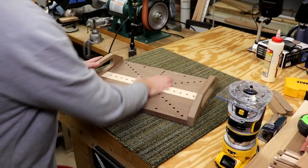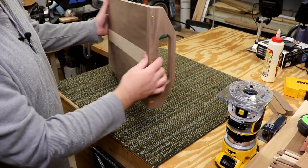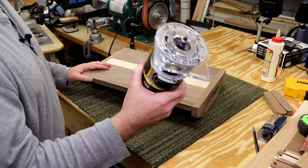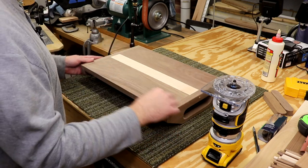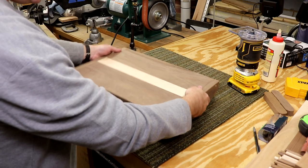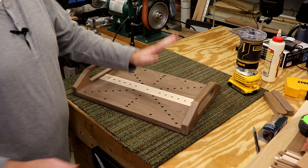The glue has been drying for about an hour and a half and I lightly hit it with some sandpaper on the back — I'm pretty pleased with that. I'd also like to carry the radius I put around the entire outside on the bottom as well. So I'm going to use the roundover bit again in the router and go around the outside. I've already done the outside face, but for continuity I'm going to run it around the whole thing. Then I'm going to hand-sand this radius, and once I dust it off and make sure there's no glue residue, we'll put some finish on it.